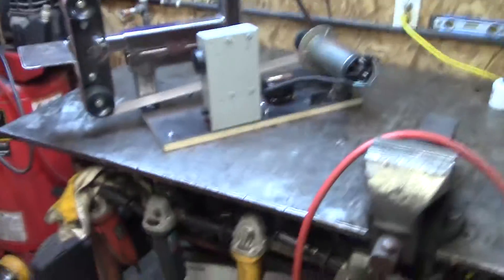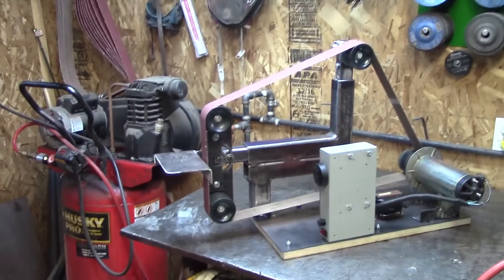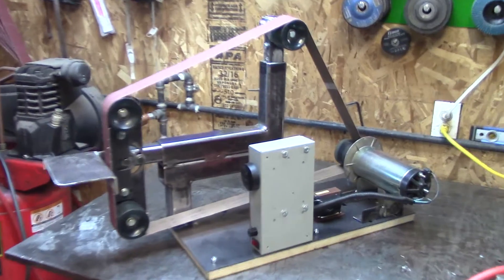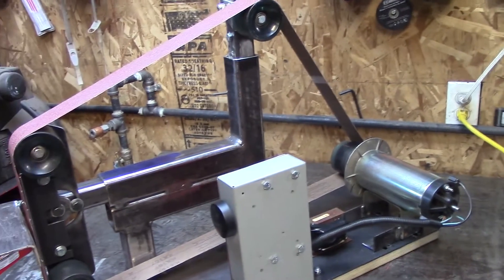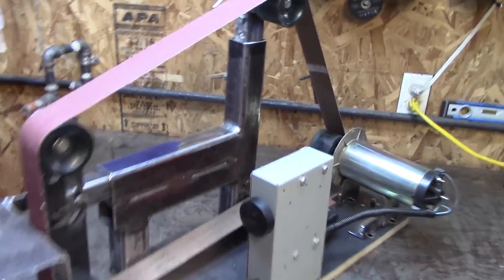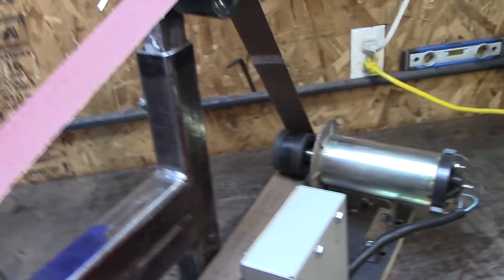So I find I like to do a lot of metal work, and I hate the grinder, so I decided to build myself a 2x72 style belt grinder. I had an old treadmill that I got from a previous project that was scrapped, so I used that as the motor, and that and a bunch of other bits and pieces. I built myself a grinder. I could say this is a 2x72 — these belts are 80 grit — and a lot of this is metal I had around.